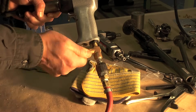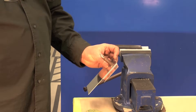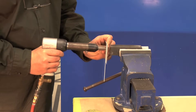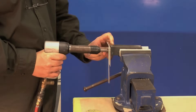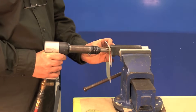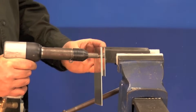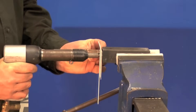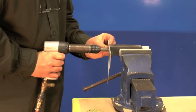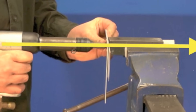Low pressure will drive small rivets and high pressure will drive larger diameters. Insert the rivet and pinch it firmly between the rivet snap and the bucking bar. Correctly done, this should allow the work piece to float up and down the length of the rivet. Pull the work piece towards the gun to eliminate head gap, then verify that the gun and rivet are held at 90 degrees to the bucking surface and that the work piece is at 90 degrees to the rivet.